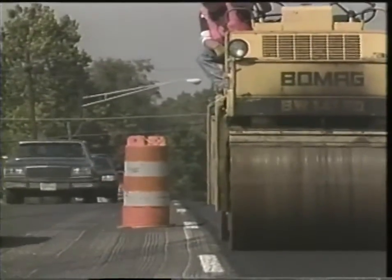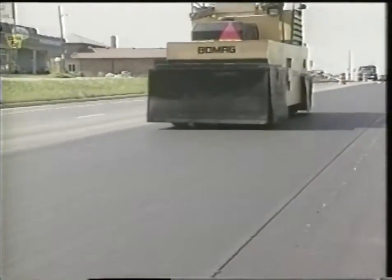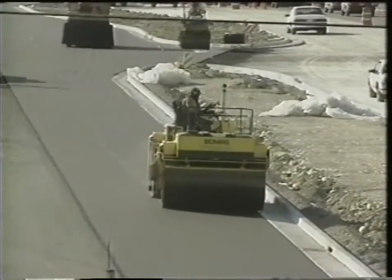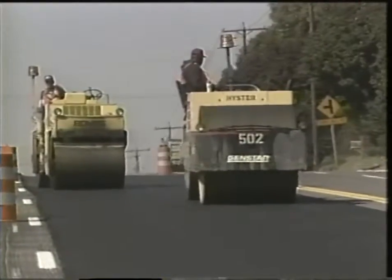As it comes out of the paving machine, the hot mix has about 85% of its final density. The remainder of the compaction is achieved by rollers that come in right after the paver. Three kinds of rollers are used: first, steel-wheeled rollers with vibrating mechanisms compact the mat efficiently; then rubber-tired rollers provide a kneading action to achieve a tight, closed texture; and finish rolling is done with non-vibrating steel-wheeled rollers that iron out the hot mix to a smooth, level surface. Roller operators have to move slowly enough to achieve the necessary compaction with the right amount of air space, but also get the work done before the hot mix cools down.